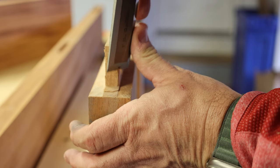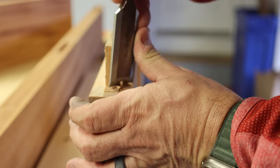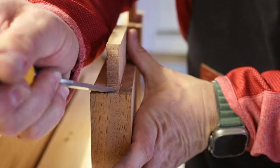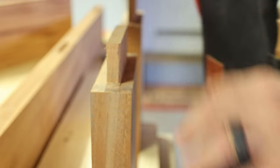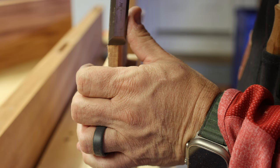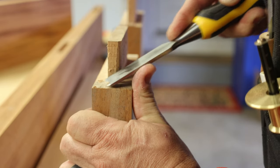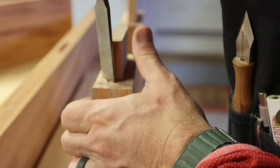Another place where I earned my money was shaping these tenons to fit properly into each one of the mortises. There was no way for me to cut these straight out of the gate with the tools I had on hand, but I did get to learn another valuable skill using my chisels. And along the way I also learned some things about chisels that are invaluable to anybody who ever needs to use them: tools that aren't sharp don't work very well. With the first couple of tenons I learned that the hard way. So take the time, make sure that you get a nice clean edge and let the tool do most of the work.